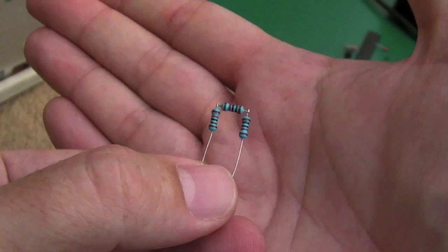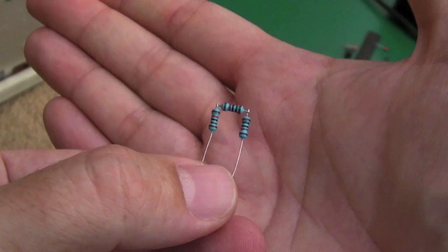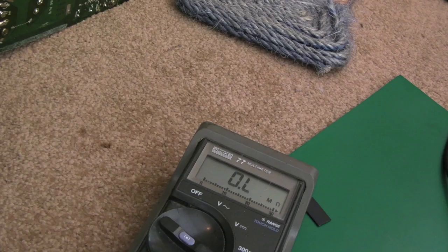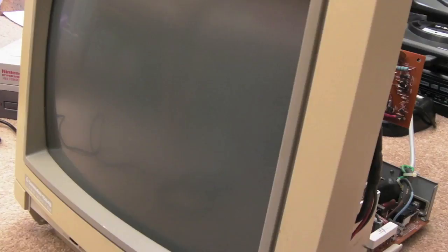So there you go - I'm going to mount that. Before you hit dislike - like I say it's temporary, I've ordered a 27k resistor and I'll swap it out. I just want to prove that that's the final issue there to do with the frame. So just measuring it in circuit, it's about 27k strangely enough, even though it's three 10k resistors - there's perhaps something else in parallel. It's not far off the mark. I'll power that up now and we'll give it a try. Moment of truth, let's give it a go.